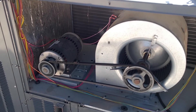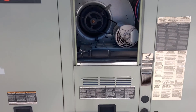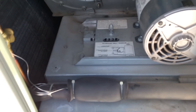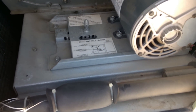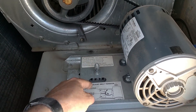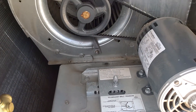We'll see if these are still holding up when I come back for the next service. Now back over here on the Trane unit — nice panel comes off, rigid, only two screws instead of a bunch that just strip out on the Goodman. Here's the blower section. They keep the belt a little shorter. The tensioner is great on these — you just loosen it, stick a screwdriver on the cog, get the right amount of tension, tighten up the lock nut. Done.